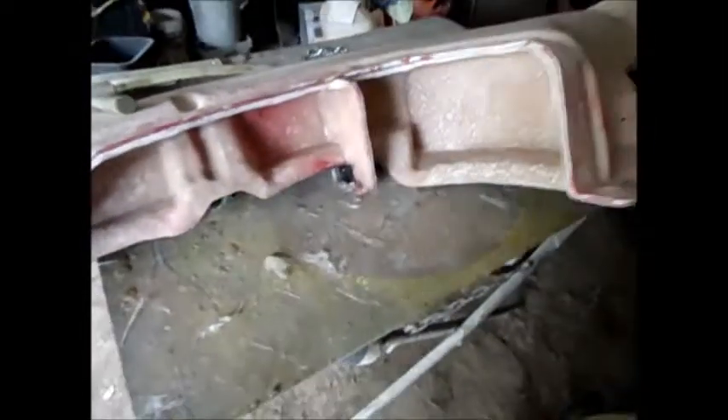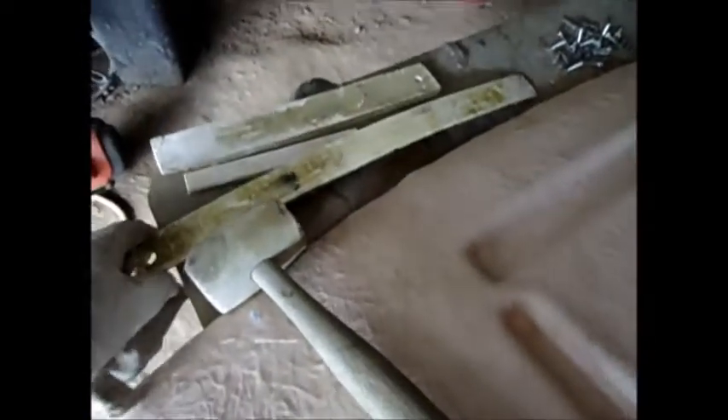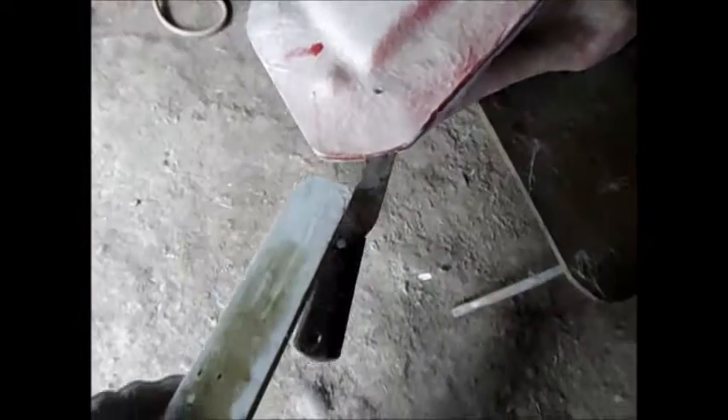Alright guys, I'm about to pop the first TV dash out of the mold. What I'm going to do is get a little putty knife right here and get in here. And then I've got a bunch of different wedges made out of plastic to help pop it. This is a three-part mold, so I'm going to be taking off the top part first.